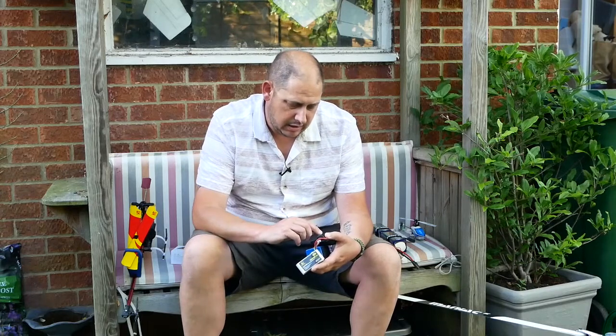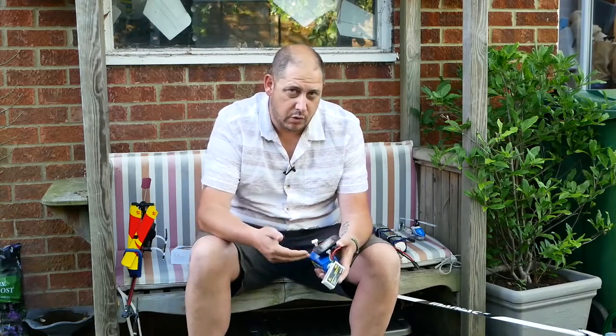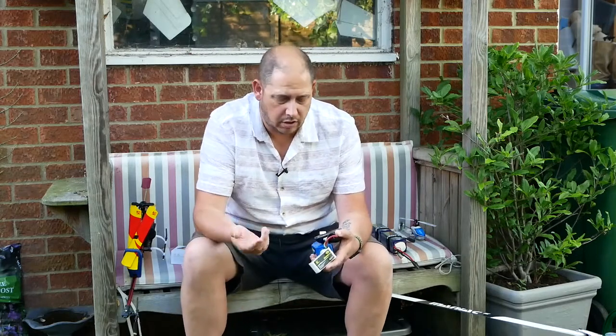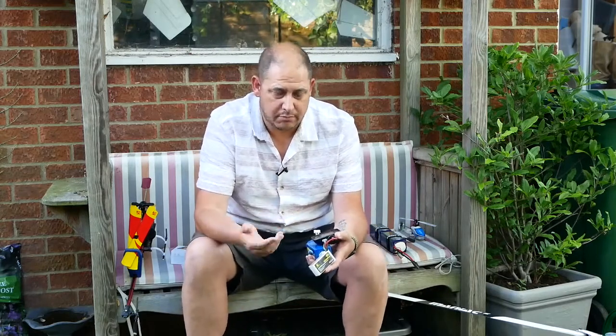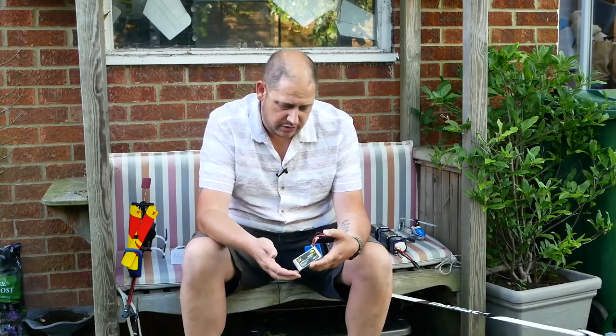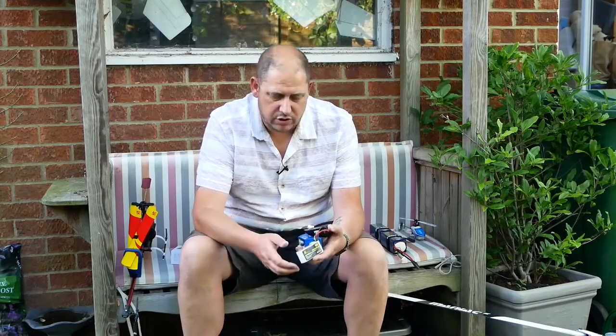The resistance hasn't come up yet — that usually takes about 5 or 10 minutes of charging, and it probably won't on this battery because it will be finished before then. It shows you how many milliamps it's put in and what it's charging at — it's already racked down to 0.7 amps because the battery's already charged. Here it says 162 milliwatt hours with a little petrol pump icon. Currently charging at 10 watts input, 8 watts output. Bear in mind this will do 300 watts, so it'll charge one of those big packs at about 8 amps quite comfortably.